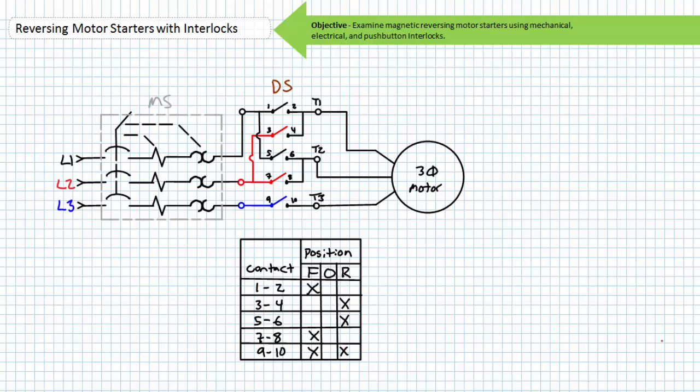This method, while appropriate for some applications, is clunky and inelegant in that the motor starter only must be used to make or break connections, not the drum switch. Drum switches are ordinarily not rated to make inrush current nor break full load current, and an operator must be trained in its proper use. Additionally, a manual motor starter is for applications manually controlled by an operator at the point of use, limiting its applicability to situations necessitating nearly constant human supervision.